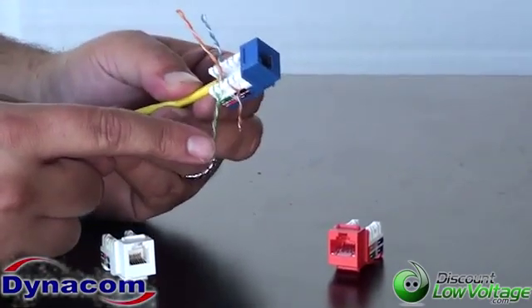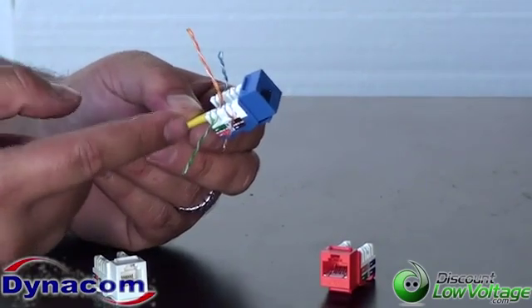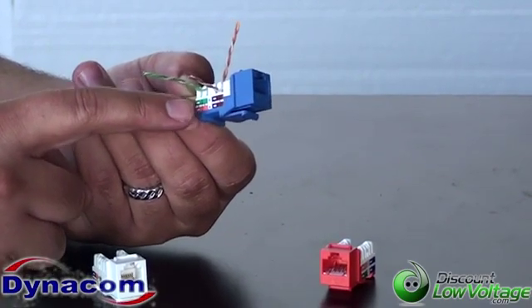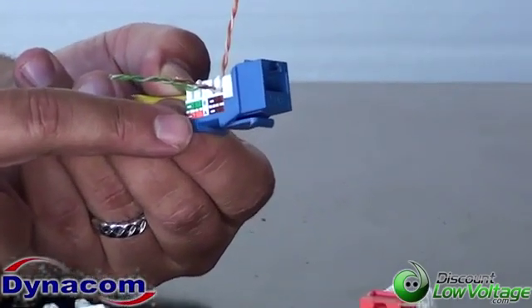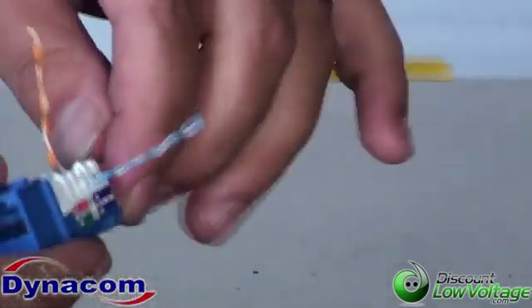For example, I have this one already wired up with the green, the blue, and the brown pair. I'm going to go ahead and lace the orange pair down in a sec. Another thing you'll notice about the 560, the Cat 5e Quick Jack — it's wired B and A and there's no split pairs. That's a nice feature when you've got a ton of these jacks to terminate on a school job or a big commercial install — just makes it a little easier.